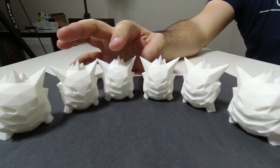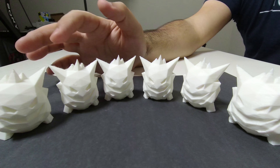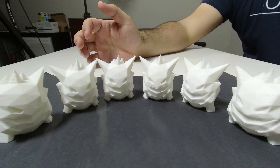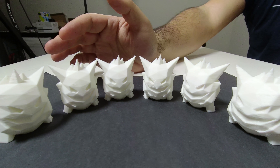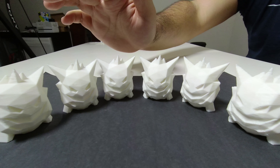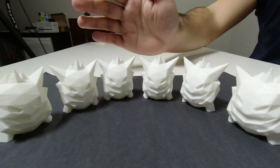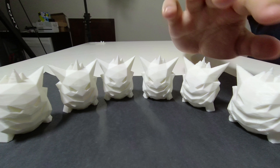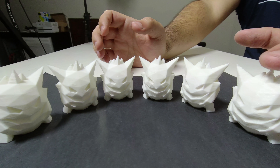One of the biggest benefits of switching to different printheads is the time savings. The biggest layer height with the thickest printhead came out in about 30 to 35 minutes — he came out quick. That time scales up as we go across: somewhere between 35 to 45 minutes for mid-range settings, and this one here is starting to be closer to the three to four hour range. The 0.15 millimeter is roughly about four hours, and the one over here that definitely looks the best took almost 12 hours to print.